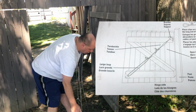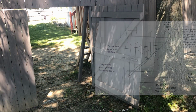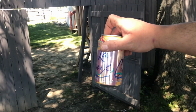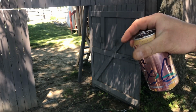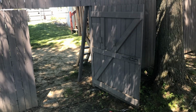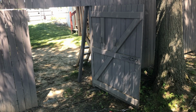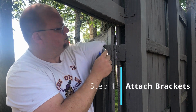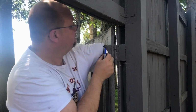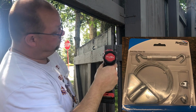It's been about 5 years since I built these gates. I should have supported them back then, but today's the day. Notice how I angle the drill away from the edge to get a better bite. I don't want the wood splitting down the road.